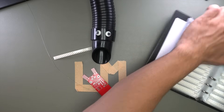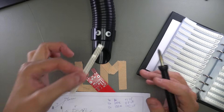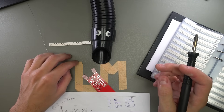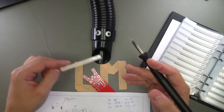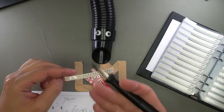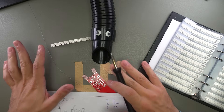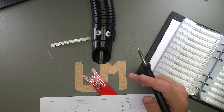The first part I need is a 1k resistor. The way I work, I only have one thing out at a time. I take one part out, take as many as I need from the tape, put them on my work surface, put them on the board, put the tape back, and then move on to the next part. If you have multiple parts out these are very difficult to read — you may put the wrong part on and then you're in for a world of hurt. Being organized is key, and I do that by only having one part out at a time.